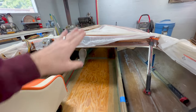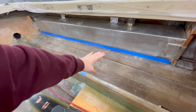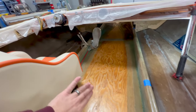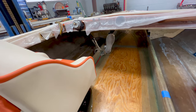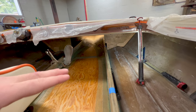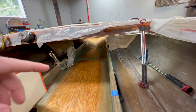This is why I didn't build those lateral supports up here by the front seats yet — I wanted to see where the bulkheads would lie and where the back floor would lie. The lateral supports just need to be underneath the seats so you can't see them, and they'll help me secure the seats to the boat, just like the back seats. With all that said, I know roughly where my bulkheads are going to be. It's not precise at this point, so I need to jump in there and start templating with some cardboard, then go ahead and start cutting the wood.